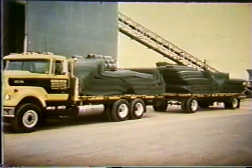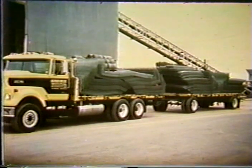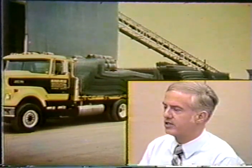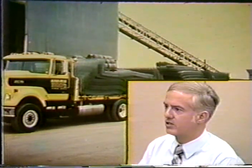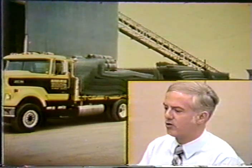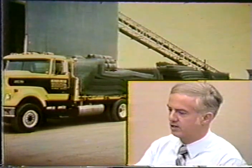Mr. Hilfiker comes from Eureka, California, and has a system of reinforced soil embankment as shown in the first presentation. There's another system which is used quite heavily by local agencies, the Forest Service also, which is this welded wire wall. The reinforcement of the ground is provided by a mesh, and then the mesh is turned at right angles to form the front face, as illustrated on the back of this truck.